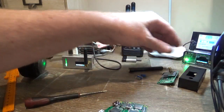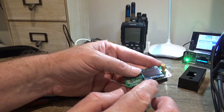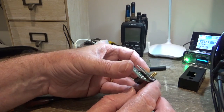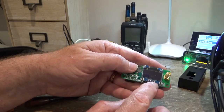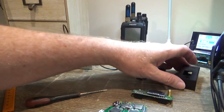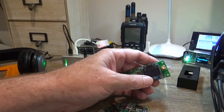When assembling the hotspot, there are a couple of things to look out for. The first is these pins here — make sure they're low and already trimmed. Even if they look okay, I'd still get side cutters out and snip the tops off, because it's a very tight fit in the case. They can come in contact with the inside of the case, short out the LED, and shut the hotspot down — or even cause damage. Short circuit equals damage.